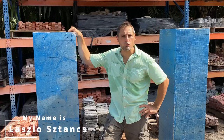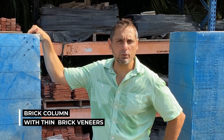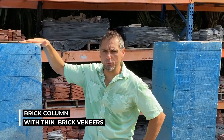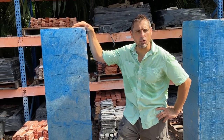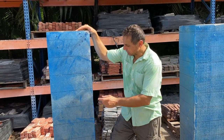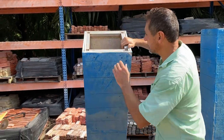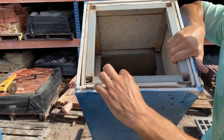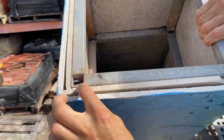Hi, my name is László and in this video I would like to show you how we make a brick column with thin brick veneers. In order to do that, we framed out three of these beautiful columns, equal size, five feet tall, and then we put cement backer boards — half inch cement backer boards — on it. As you can see, the inside is made with a metal frame, it's a one inch tube.